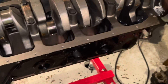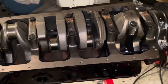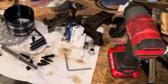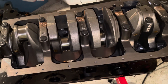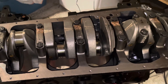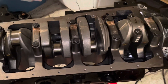This particular engine is the customer's block — there was nothing wrong with his block. He had oil in the hole but we never really found out where it was coming from, and there was no damage to the block, so I'm reusing it. I'm also using the crankshaft — there was no damage, and this crank wasn't even turned. If you look at the part number, you'll see it doesn't say dash 10 or whatever, so this is not an undersized bearing — it's a factory stock size bearing. If you want to get a 3.0 liter engine or a boat with a 3 liter engine, you need to stay in the earlier models. I'll find out the exact year the design changed and post that in the description.